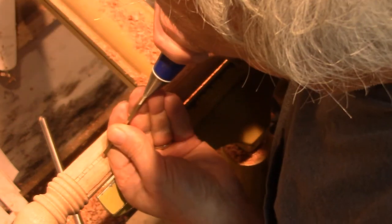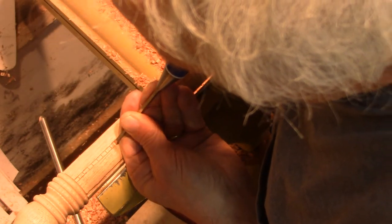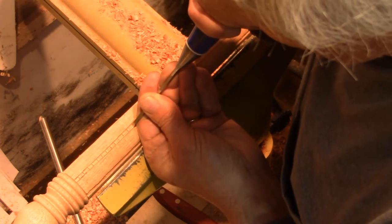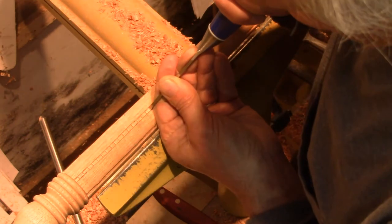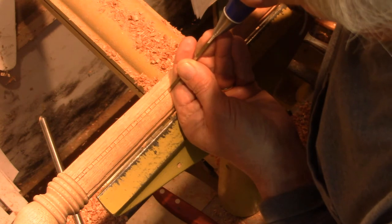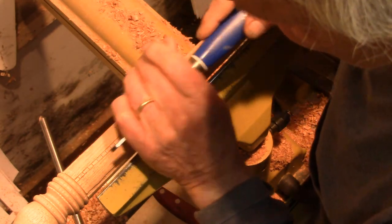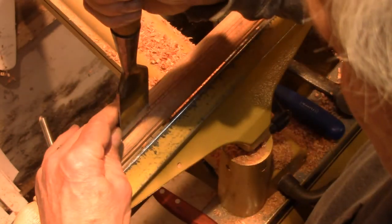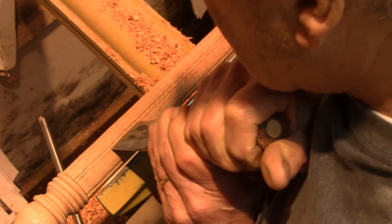That tells me two things when I cut down like this. It tells me the width — whether I've got the parallel cuts with the knife at a proper width. And it also, if a little strip starts to tear out, it stops the tear out. A third thing it does is that it allows the chisel to work a little bit better in taking out the material. In areas where the parallel lines may be a little skinny and not enough, sometimes I'll use the chisel and place it right where the end of the chisel shows.